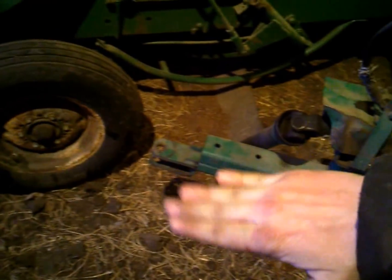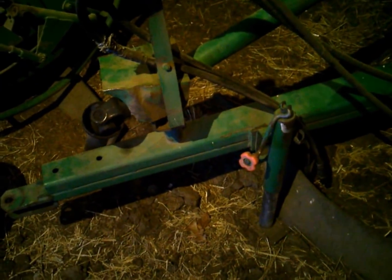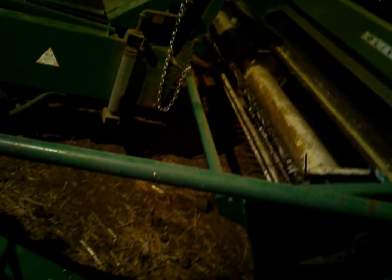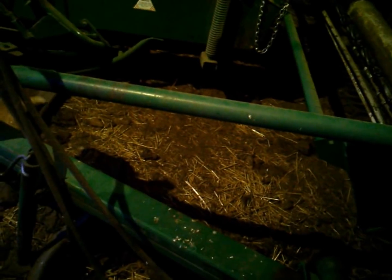A swinging drawbar, obviously. All sorts of holes there for whatever tractor you're pulling it with, or however you want to do that. You can adjust how much the mower leans back like that. You can take this drawbar and move it up to the next set of holes, or flip it over, to get it to tip back. I've got it tipped back quite a bit just because I don't like getting little stuff stuck on the sickle, chunks of grass or whatever. It doesn't pick stuff up quite as well, but if you run the reel a little faster, it'll pick stuff up.